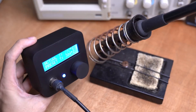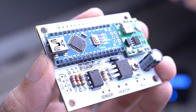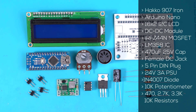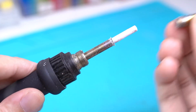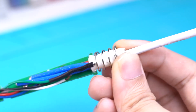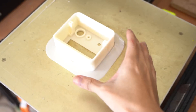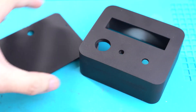If you could stand to upgrade your soldering station but you're not ready to splash out on a Hakko system, Angelo from TechBuilder claims he's designed an equivalent soldering station for just seven dollars. That's an impressive figure, but it doesn't cover all the costs — you'll still need your own Hakko compliant handle. He has recommendations for a similar handle, then replaces it with a genuine heating element. From there he's provided a custom PCB, Arduino code, STLs, and the rest of the BOM for you to build your own. I think I see this one in my future.